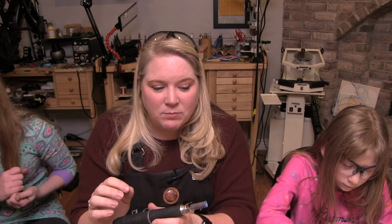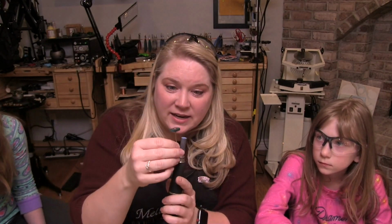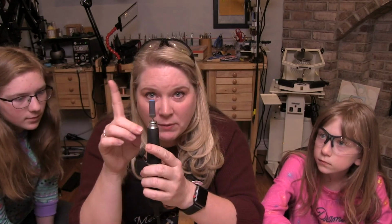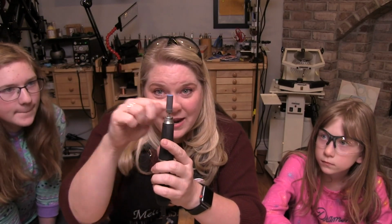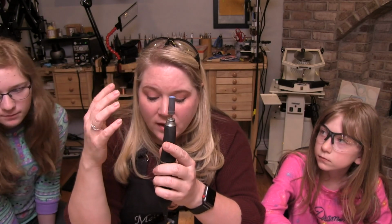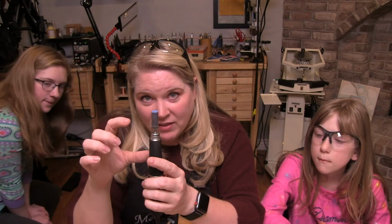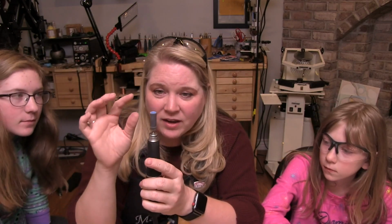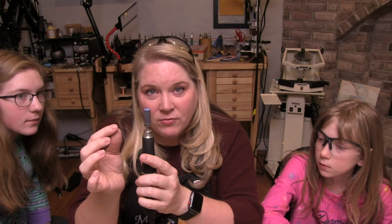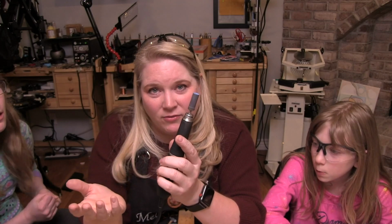I have actually seen people post a photo where they'll have some kind of maybe a silicone wheel or the radial discs or whatever else, and it's been in here. One, it was probably out too far, but two, there's a nice little 90-degree bend in it, so it's sitting in here at a 90-degree bend. And what happens, especially if you're going at some higher speeds and you've got that longer, thinner shank in there, you get a little bit of force on something and it bends it, and that centrifugal force pulls it down even further.